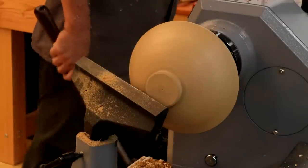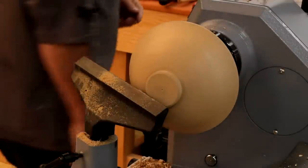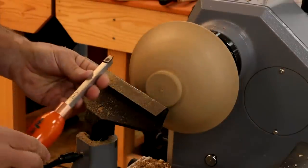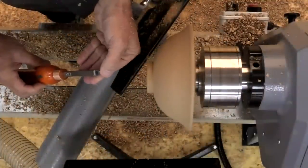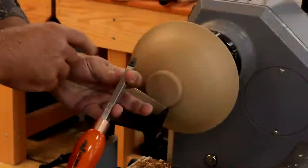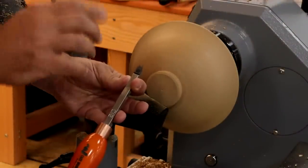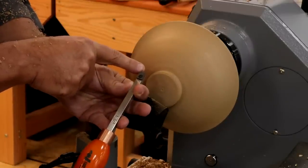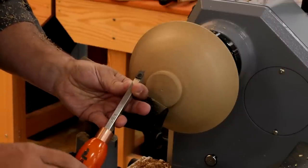I'm having a quick glance at Mark's design because I want to try and keep true to it as much as possible. We're now going to use the EasyWood beading cutter — probably one of my favorite EasyWood tools. This is one of the beading cutters. I used to use a captive ring tool, but the trouble is they don't have a pointed corner like these do. These are specifically made for beading.